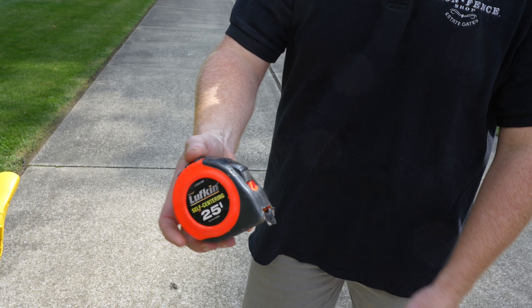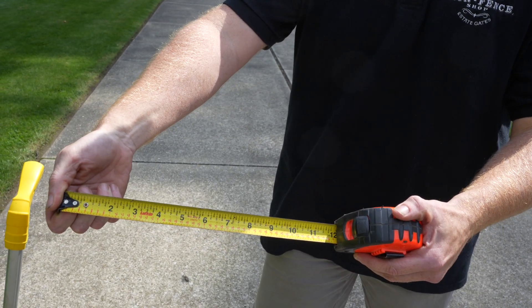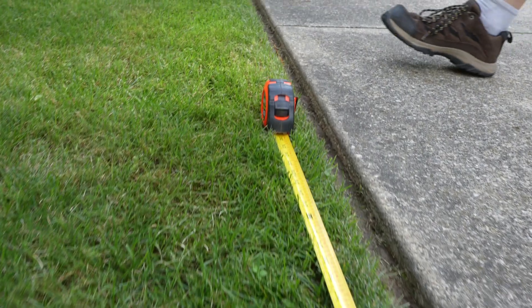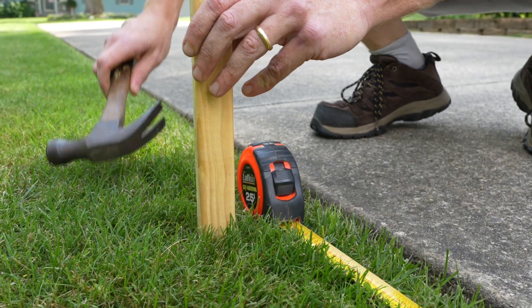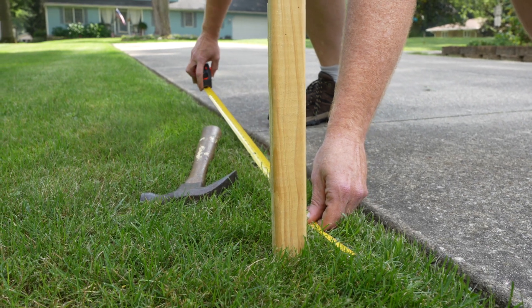Let's start simple with a good old tape measure. These are cheap and you'll likely have one hanging around in your house somewhere already. If your fence project isn't too large, these are a great and simple option. I'd use at least a 25-foot long tape. If you need to go further than the length of your tape, simply drop a marker or put a stake and then start measuring from there again.